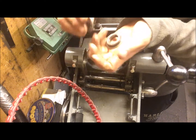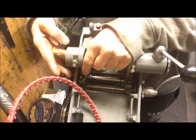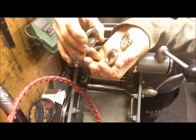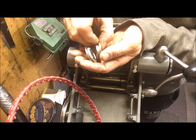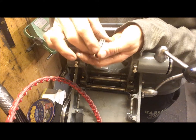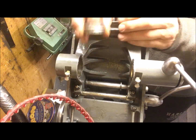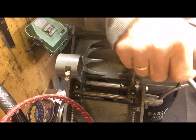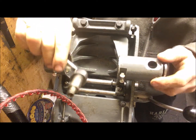Now this is loose. I can remove the thrust bearing inside here — which is really these parts — with another washer or distance piece, whatever you call it. Now I can pull off the lever here, pull it straight off.